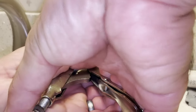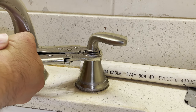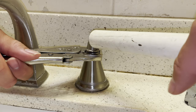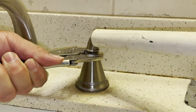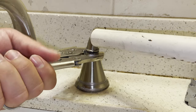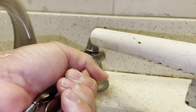The pliers were slipping, so I removed the duct tape and clamped the pliers directly to the faucet as tight as possible so the teeth would bite into the metal. The normal range of motion for the cold water handle is between three o'clock and six o'clock — I'm being careful not to go beyond that or I'll break the cartridge.